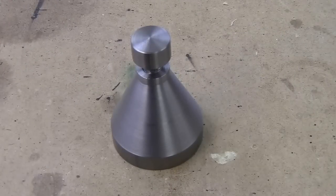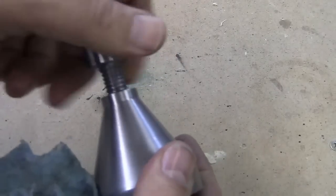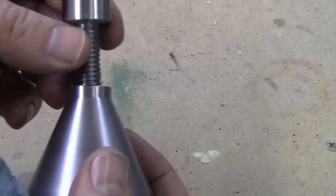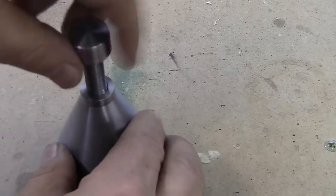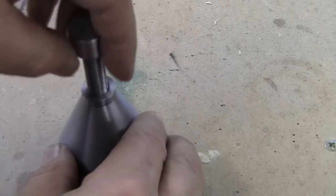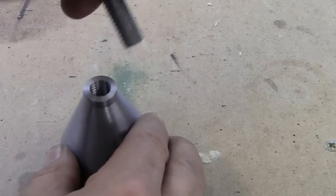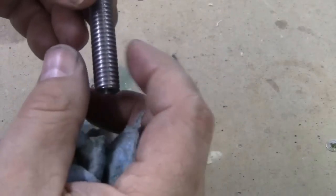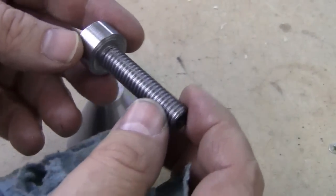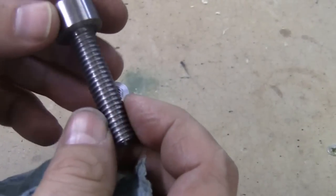Here's my first attempt at a jack stand. The first thing I discovered right away is that I made the diameter of the bolt just a little too small — you can see there's just too much rattle in there. So the threads are right — 7/16ths 14 threads — but I looked on the internet and thought I found the right pitch diameter, which I believe was supposed to be the diameter of the blank before I cut it. Anyway, this is too narrow, so that's flopping around in there. So I'll probably make another one — I'll do it exactly the same, so I will do it off camera.